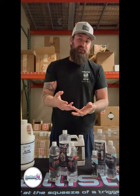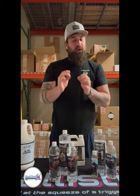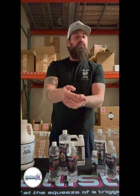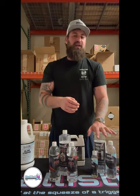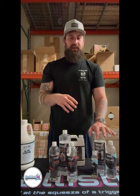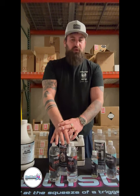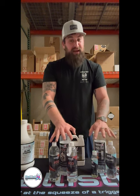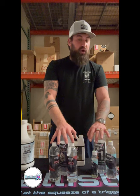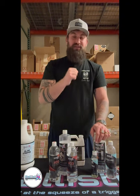This gives you the option after your job's done to go back with your iPad, get your Google review, apply over the flake, and leave. This is a great upsell, and many installers are offering this out of the gate on their flake jobs with the option to move down to a polyaspartic. Talk about tire transfer — Z-rated tires are some of the polyaspartic's worst enemies. Squire will prevent this. It's also UV impervious. NCO is also used commonly in the epoxy world, but we also see it in the stone world — stone, hardscapes, etc. It's very much like the single component and Counter-Attack: a variation of the same product but a little bit thinner, which doesn't make it any weaker, just makes the application process a little different.